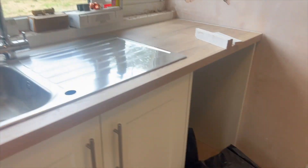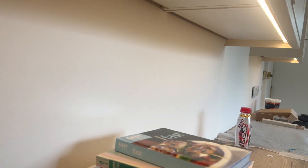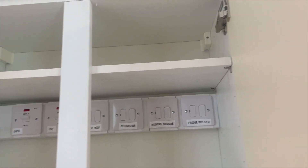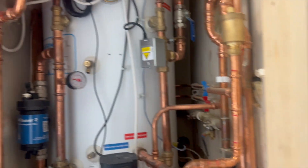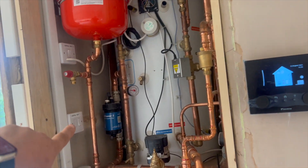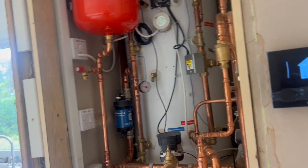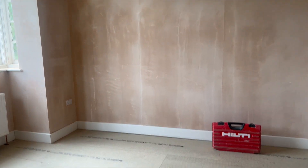We're actually nearly finished here but the builders are still working. The fridge freezer, all the appliances and sockets underneath are ready to go. We've got the LED strips in there - the builder's hole was too big so we had to fit trunking, which looks alright. We've done the heating isolator. With the air source we just leave the supplies to them - we provide the two isolators and that's our scope. The cover on the heating controller looks like it's missing so I'll let Alex know.